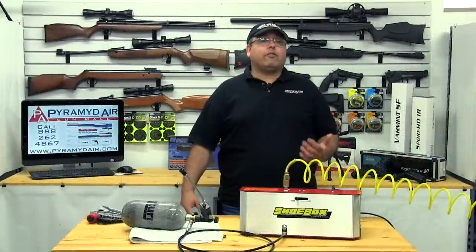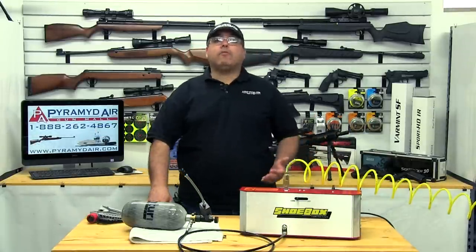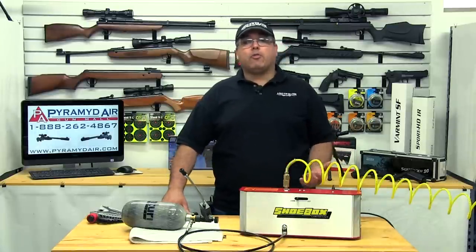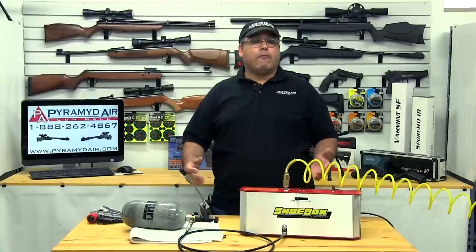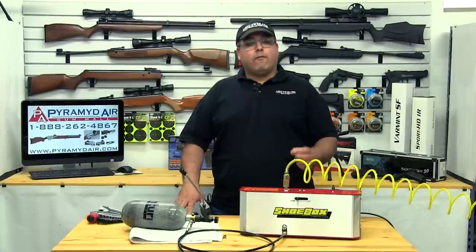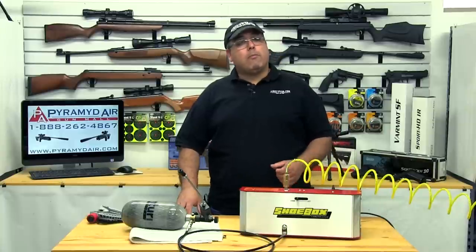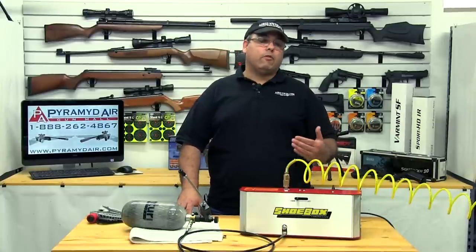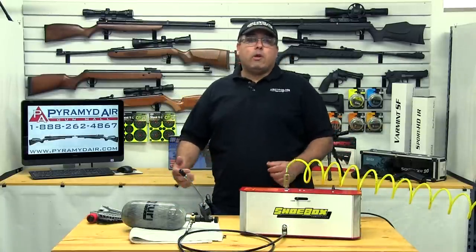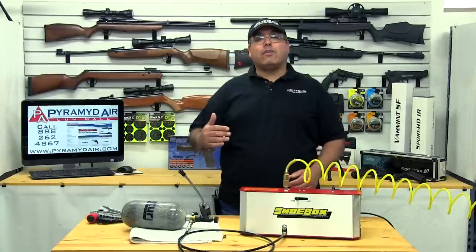What's the best way to utilize the Freedom 8 electric compressor? That's really going to vary from user to user, but I'll share how I use mine. I've grown to absolutely love my Air Venturi regulated fill system — it provides me more than enough air for my time at the range, and I'm able to leave all my big gear here at the shop. Before I head out, I simply top off my bottle with the Freedom 8 and I'm good to go. The Freedom 8 comes set to turn off at 4500 psi, which is perfect for my 4500 psi carbon fiber bottle. Depending on how depleted my bottle may be, it takes 30 minutes to an hour to get it back up to full pressure. I also use it to keep my other tanks topped off — since they're all either aluminum or steel, I can't take them to the full 4500 psi, so I set a timer on my phone and keep a close eye on the pressure so as not to overfill them.